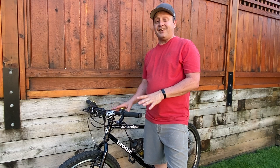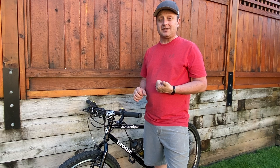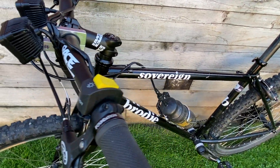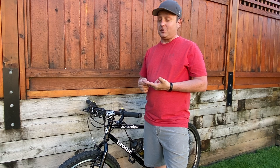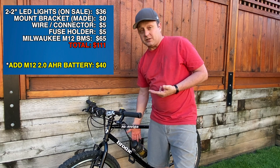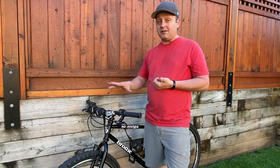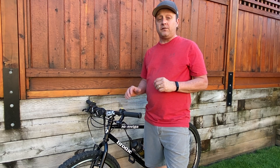I love the way this light system turned out — it is awesome, the best one I've made so far. It's super bright with 3,000 lumens, which is more than enough for any trails I'm going to ride. It's super robust with cast aluminum housing, metal brackets, thick wire, and the battery pack is a drill battery meant for construction-grade rough and tough use. As for cost: I already had the drill battery, but with the battery management system, two lights, and bracket system, you could build this setup for around $150 — and it would rival systems worth $300, $400, even $500.